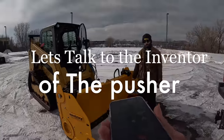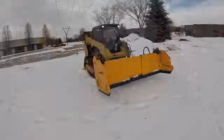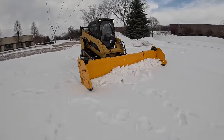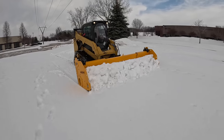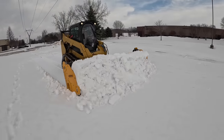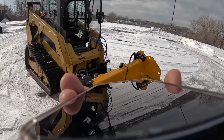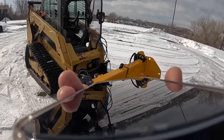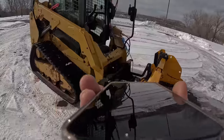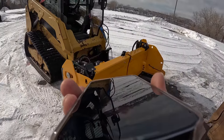Now, the one that I have on my pusher, what size does it go from and to? From 7 feet to 12 feet open. Mainly, this pusher was designed for cleaning driveways because when you do straight driveways, you have to do back drag, and also sometimes you have to push. And this is why we came with this pusher. 712, it's because we are using it for 75 skid steer horsepower. We have smaller, like 6 and 10 feet open for a smaller, like 65 horsepower.